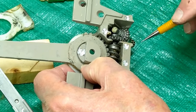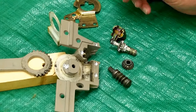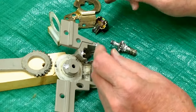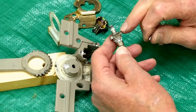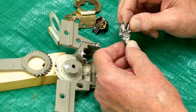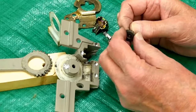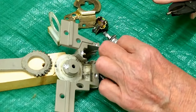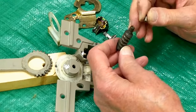This is a small magnet. This part is non-magnetic — it's probably a piece of zinc, die cast. This is magnetic. It looks like this has been pressed onto the shaft; it may have been machined. I would think that would be a type of cast iron. It looks like pot-metal cast iron of some sort. And this part — the worm — appears to be machined in one piece.